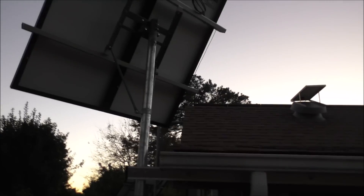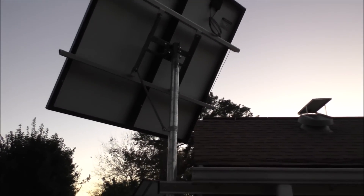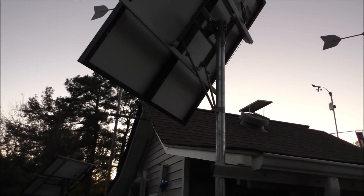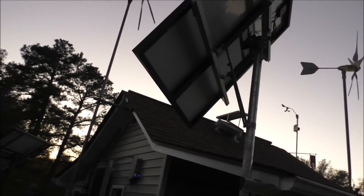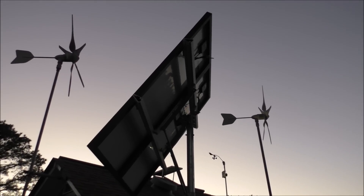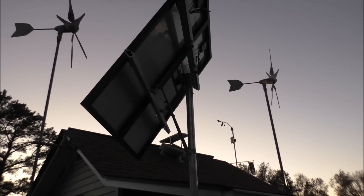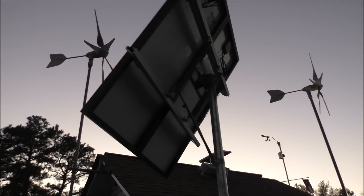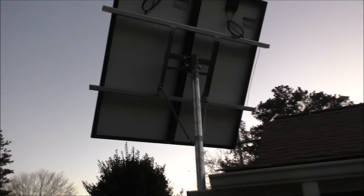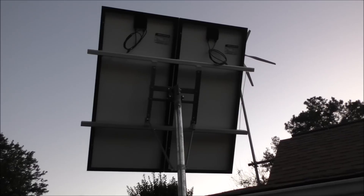There she is — that way I clear the roof and stay a whole lot cooler. That's probably at about a 37-degree angle — right for this time of year in November. There she is — Mars Solar, Mars Energy Corporation makes some nice brackets. Those are the wind struts right there. These are High-Tech Solar 180-watt panels — two of them, so that's 360 watts total.